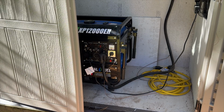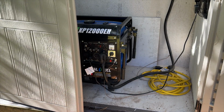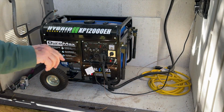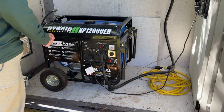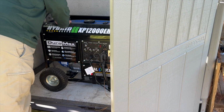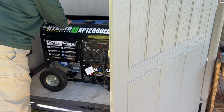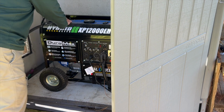The natural gas is on. Right. Now at this point, I have to bleed the system. And on my regulator, there's a little purge button. I just got to find it. Oh, here it is. We have to push that until the natural gas comes through the system. Until I smell it. Now I can smell it, so I know that the line is energized.